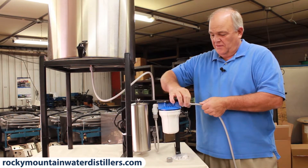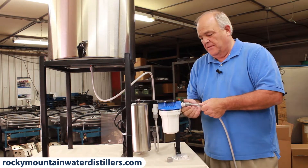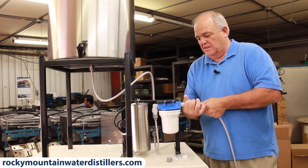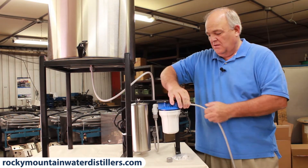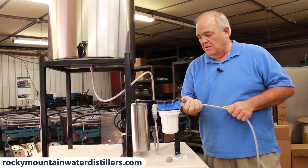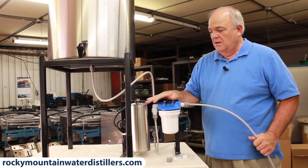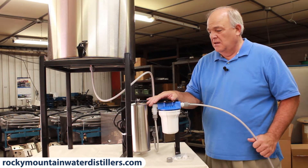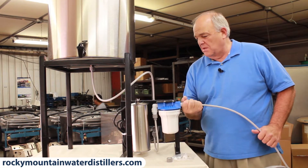Tighten this one up fairly tight because it's going to have 60 pounds of pressure on it. When you get 60 pounds of pressure on this line, it shuts the pump off — it's an on-demand pump. When you open your faucet and release the pressure upstairs or wherever you're running water, the pump turns back on. The accumulator makes it so it flows in a steady, sure stream, and you don't get a pulsating action on your stream, so it makes it really nice.